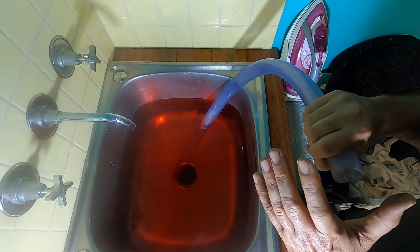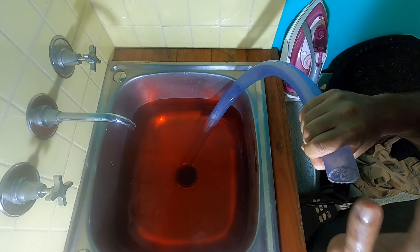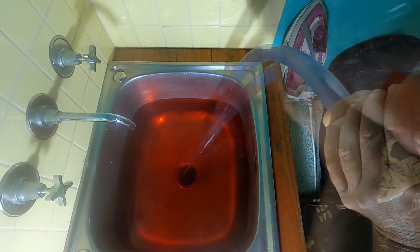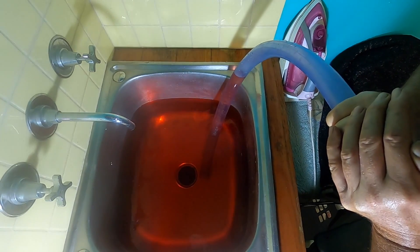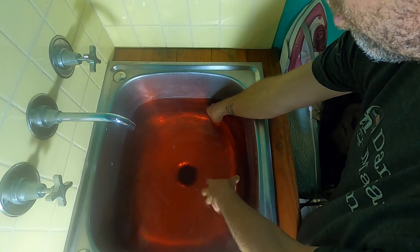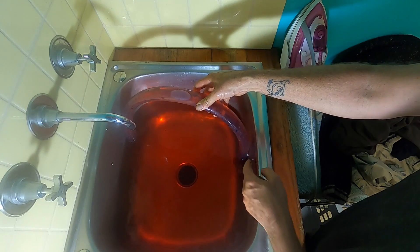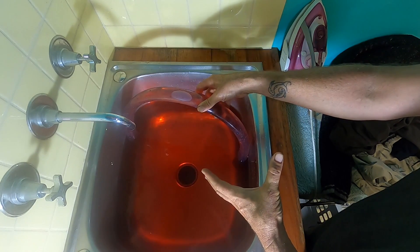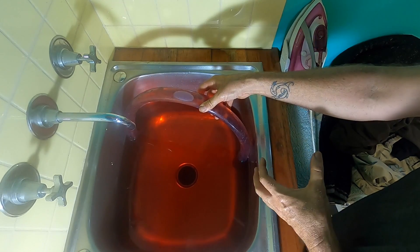As soon as I stop sucking on it, it goes down. Don't get me wrong, these pumps are pretty airtight. So if I draw water up and then just stop, the fact that the pump itself doesn't allow air to flow through it means it stays pretty well primed. That's just me holding my hand over the edge of the pipe, which is the kind of seal you would generally achieve with the blades inside the Jabsco impeller pump. Obviously if that goes, the whole thing goes back down. The difference with Renko is that because both ends are below the water line, it never loses prime. That Jabsco pump could leak a small amount of air and it'll still stay like that. Then as soon as you fire it up, you're back in action — that's the advantage to having both the inlet and the outlet below the water line.